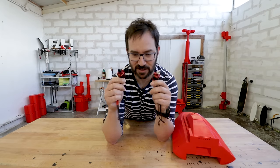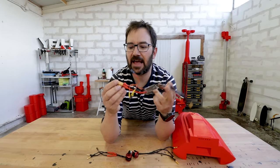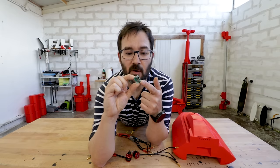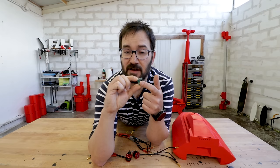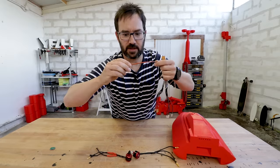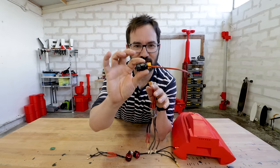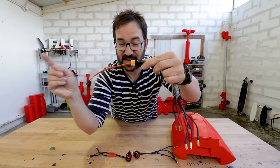I've already done the wiring on the ESCs, and in here there is one of these DC-to-DC adapters which gets the 12 volts from the battery and gives you whatever you adjust, which in this case is five volts for the radio and the servos. This is an inline BEC with two XT60 connectors — it will give you five volts to use in your circuit inline. You connect this in here and on the other side the battery and you are done.